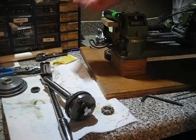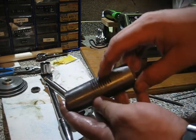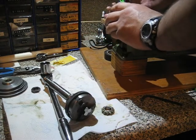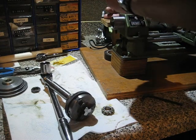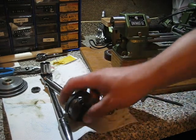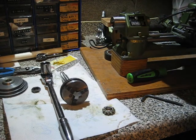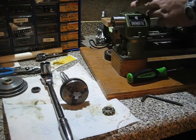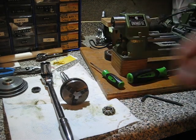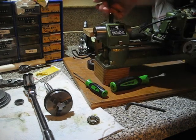Now that I've got everything greased up, I'm going to put the spindle housing back in the headstock. You'll want to put it in this way — the gears you want towards the back — so that the spindle can move in and out of the headstock. Then you'll want to line up your screw hole with that part that's been cut out so you can have your screw lock down the spindle when you need to lock it down for lathing or whatever. Then you can put the lever back in. That screw isn't tight but it slides in and out fairly nicely now.